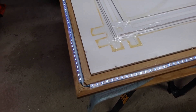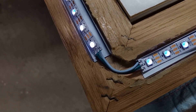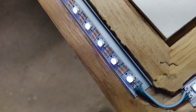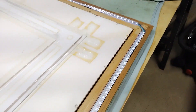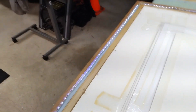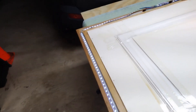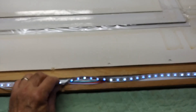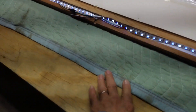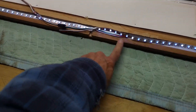We have the wiring done — soldering, little connectors on each end joining them together, as you can see. You have to be aware of keeping the direction because it is a directional LED strip. The arrows are pointing this way and we went all the way around. We have it all set up and it's working. There's the control board; the other corner is where it's going to be coming out at the bottom. We haven't glued it down yet, and that has to all come apart and get soldered up properly. We'll document that and show it before the covers go on.